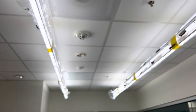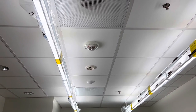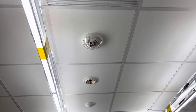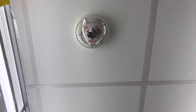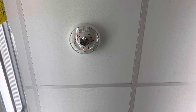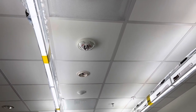On the ceiling I added a strobe right here, so this is where I changed the end-of-line resistor from the wall to this device right here. Then for the smoke detector, I opened the smoke detector right next to it — in the middle right there — and took one of those wires and put it on the other side with the coil. From there I added another wire back, pulled another wire back to the fire alarm smoke detector, and wired that back together.